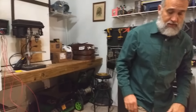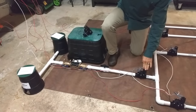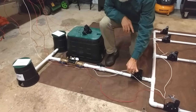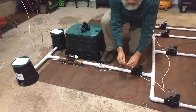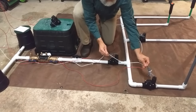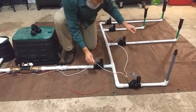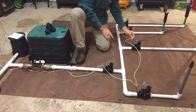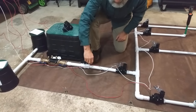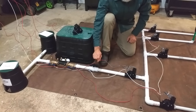In this scenario, we have what we call a master valve. Out of the controller, the common wire comes out and it's connected to this master valve — you can see that it is spliced in. And then it goes to every single valve, where this one wire is cut and spliced with the wire from the valve. You can see all four valves, it's the same way, and then each wire has their own dedicated wire with its own slot.